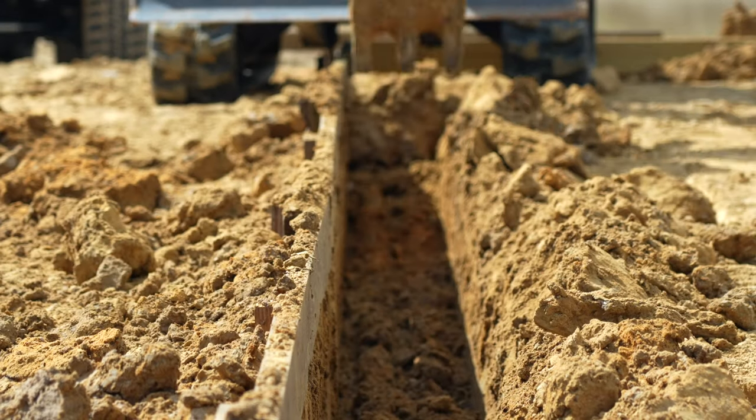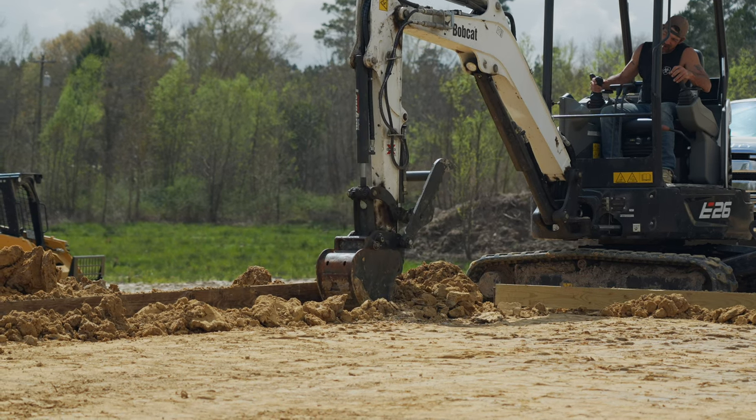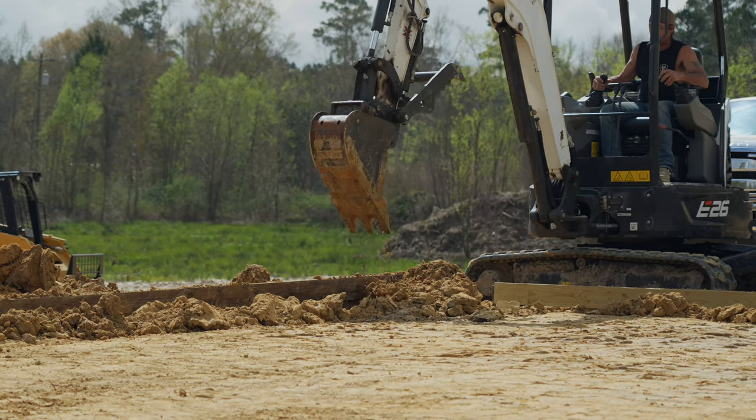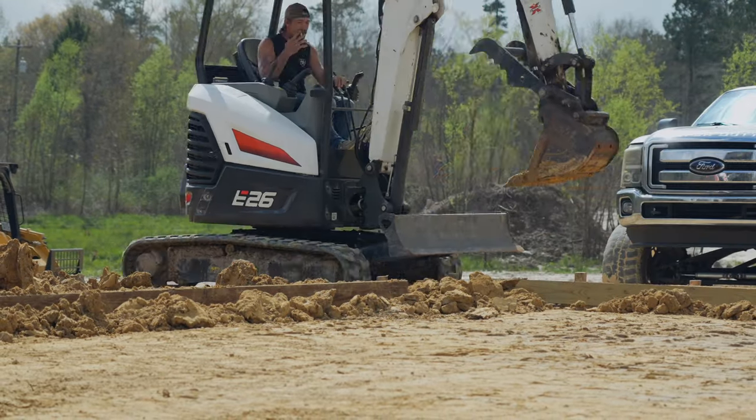The perimeter walls are always load-bearing. That is why we go ahead and put footers inside the perimeter of the form. If you have load-bearing walls inside of the building, you should also dig footers where those walls will be placed.